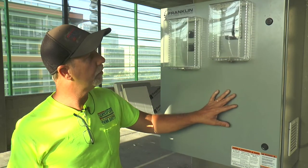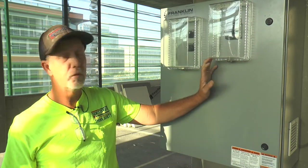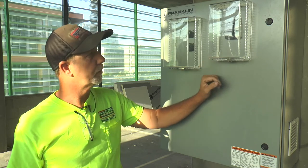Good morning. My name is David Bellevue. I'm here with Spectrum Mechanical as a representative to do an owner training at the Lynx for the equipment above. Currently we are at Supply Fan 2, which is a stairwell pressurization unit. It is designed for the fire system — when fire goes into alarm, it pressurizes the stairwells to keep smoke and fire out. We're at SP2 and want to give a quick overview of what the equipment is and its purpose.